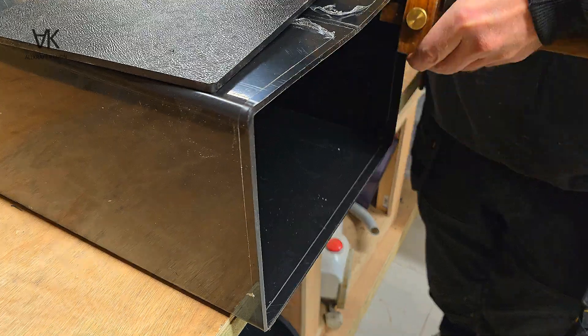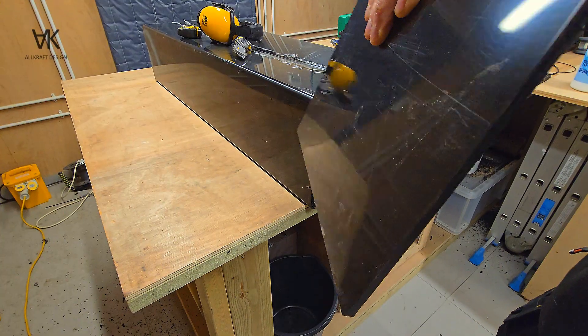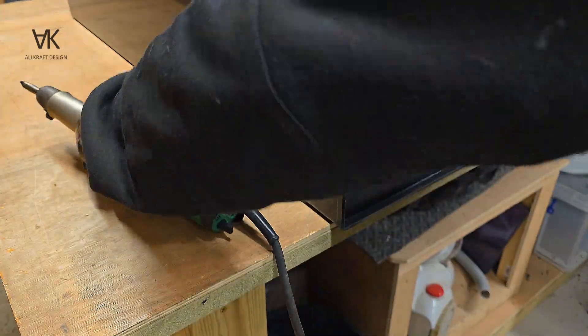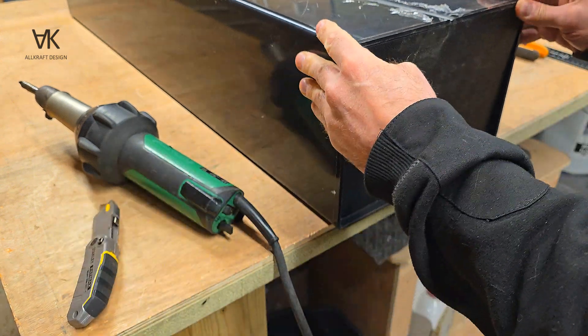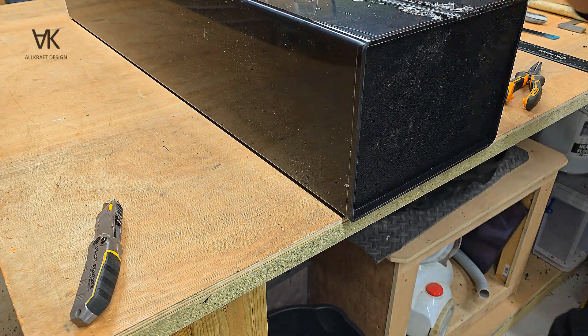Here I'm just putting a back mark on the inside of the job for this end cap, which is 6mm embossed polyprop — it's got a bit of a grain on the outside of it. I'll just Stanley knife and push that in there, and I'll tack the rest of it around to that mark.